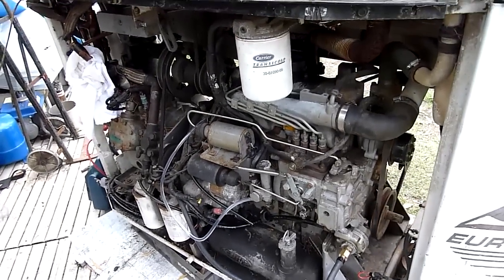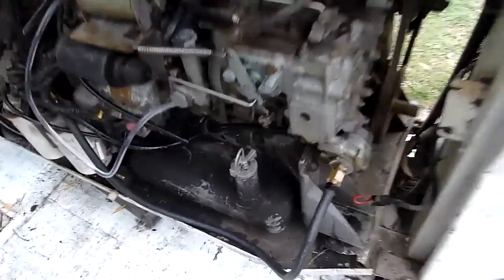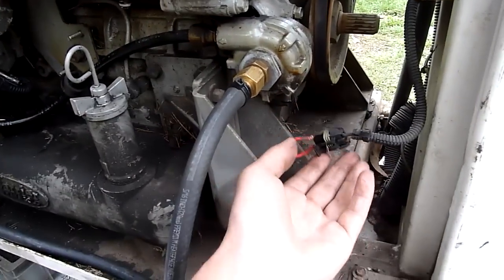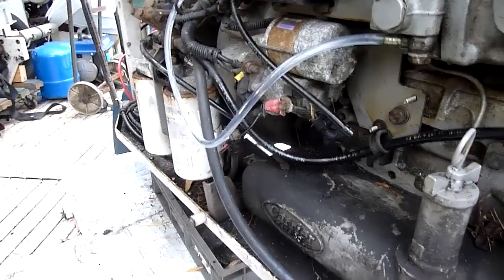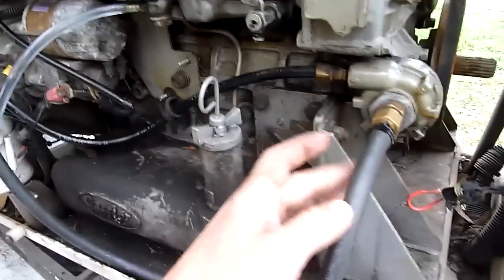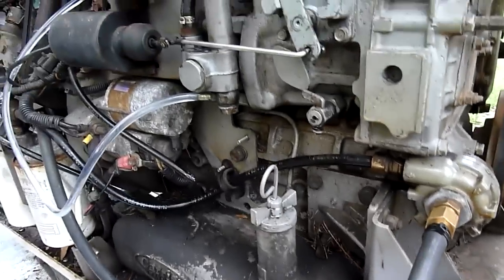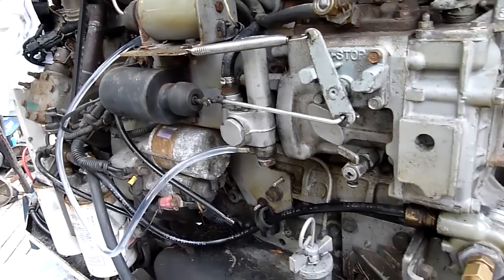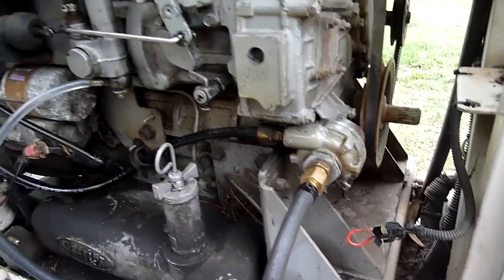So it's a decent sized engine, it's not small. I've obviously fixed the smashed fitting and the smashed oil pressure sensor for the time being — I do have oil pressure, I've checked it. This hard line was smashed off along with the little manifold and pressure sensor, so that's all fixed for now. It goes straight to run and works properly. It was only shutting off because of the low oil pressure.